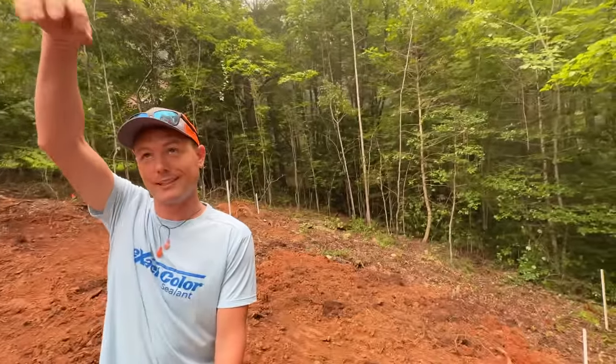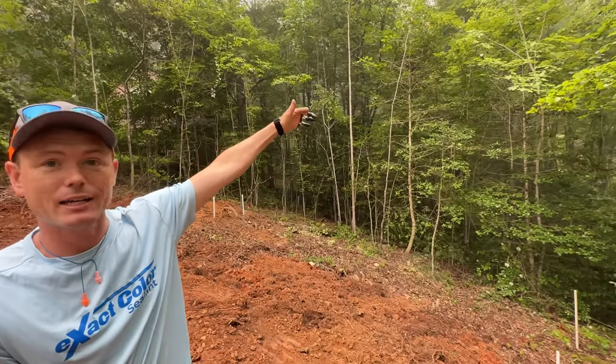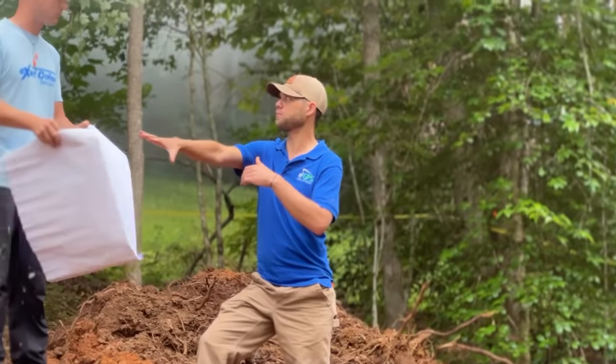Yep. And we've done this on tons of jobs. It does work. You can do it. That's called getting triangular. Yeah. No, but seriously, you could build some batter boards. That would be great. But yeah, we're talking 10 feet high in every corner. That'd be tons of material and time to just build the structure that would actually hold your string lines.